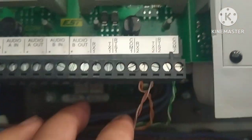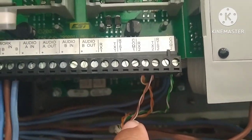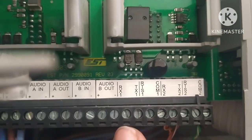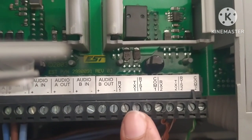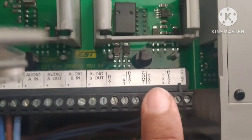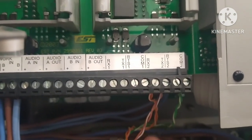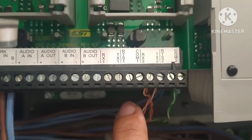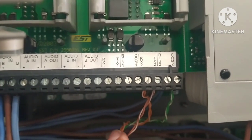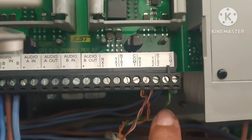Here we have the connection — we can use a 3-core cable for the printer. The connections are: RX1, TX1, RTS1, COM1 — common — for port 1. For port 2, we use a 3-core cable: orange cable for RX2, gray cable for TX2, and the last one is common.